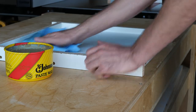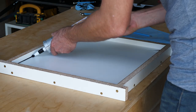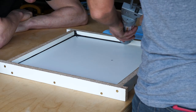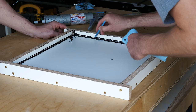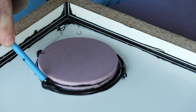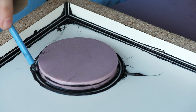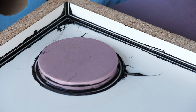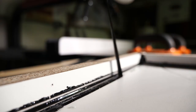To do that, I started off by building a melamine form, which is pretty straightforward — just five pieces that go together, and the interior dimensions dictate the size of the finished slab. Next, you're going to want to apply a healthy coat of wax to your form. This isn't going to be for the concrete but rather for the next step, which is to apply silicone to all the interior corners. Right after I put the silicone in, I used a fondant modeling ball tool to create a round-over in all of the corners. We also cut out pieces of foamular using a hole-cutting saw and siliconed them in as well — these are going to create little cup holders in the finished top. One tip for next time is to get a good layer of shellac to make the foam watertight. After a few hours the silicone was dry and we could pull out all the extra little bits — and this is why you wanted that coating of wax, otherwise it would just be really tough to get this stuff out.